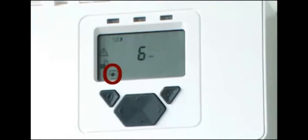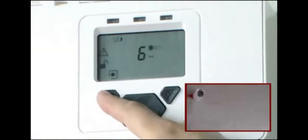The first stage of alignment is to align the receiver onto the transmitter using the integrated laser in the receiver. To activate the laser, select the second icon. The display now shows how many minutes the flashing laser will remain on for. This can be changed if required. Press tick to accept the number of minutes and turn on the laser.